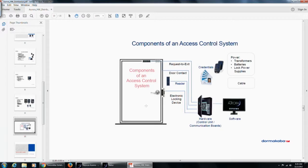If anybody has not ever wired a Wiegand reader, you're essentially looking at four basic wires, potentially five or six. So you're looking at a red and black for power that goes right back to our control panel reader ports. You're looking at your green and your white, which is your data 0, data 1 on a Wiegand protocol. Then you have your LED control, and that is typically just so that we can show a red LED when the door is secured and a green LED when the door is unlocked or unsecured. Essentially it'll be red. Somebody presents a credential, they get an access granted, it'll turn green for your unlock time of that door and then return back to red.